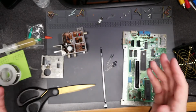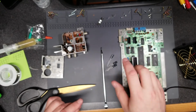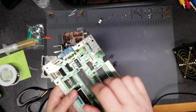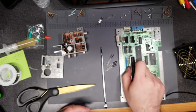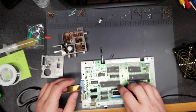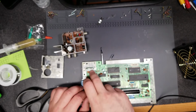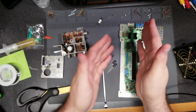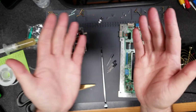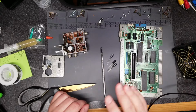Leave some comments below if you have any suggestions or ideas on how I can utilize my 65-watt soldering iron and desoldering gun to be able to do this in the future, because I don't want to have a repeat. I probably should have tried desoldering with the gun and the iron on the other side at a lower temperature. I mean, combining the two, so it'd be 130 watts total. Maybe that would have been enough. I'm not sure. But if you have any comments or suggestions, leave them below.